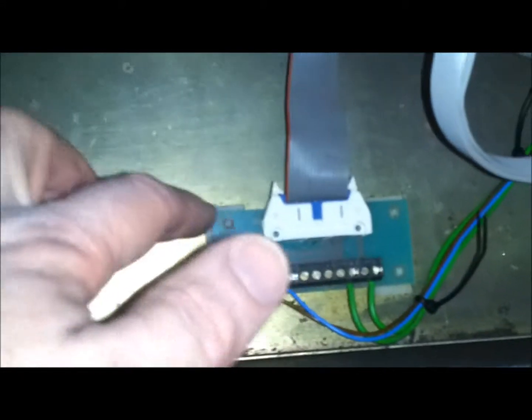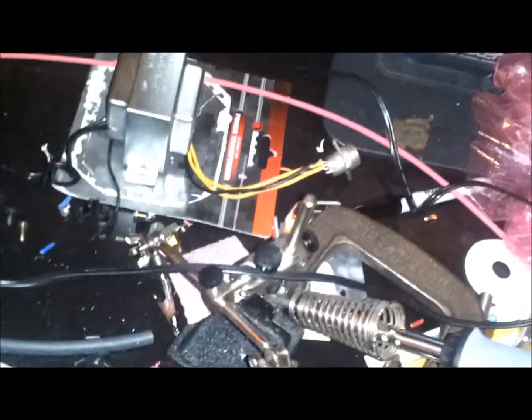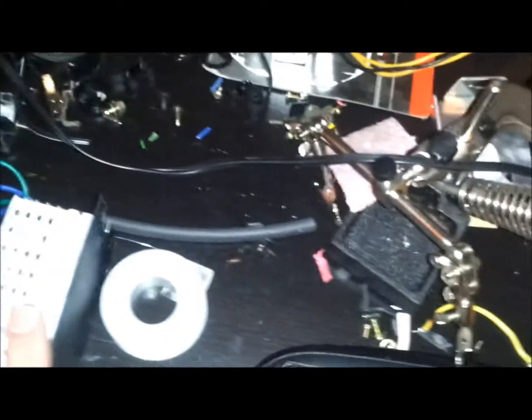Okay, well, I had this kind of loose here so I could check all the voltages, and I think this was actually kind of resting down here and shorting out one of the rails or both the rails, so I just stuck it back up on the standoffs, and yeah, everything seems to be working right now, so hopefully nothing's getting too hot. This is pretty warm, but it's, you know, hopefully doing its job.